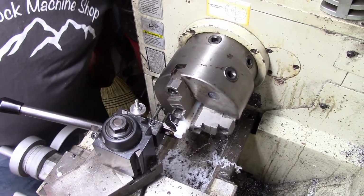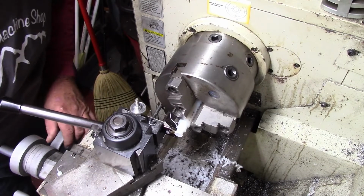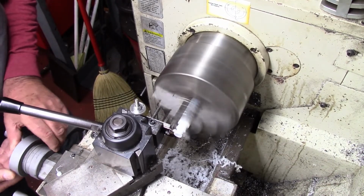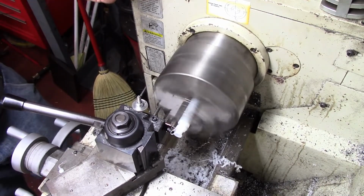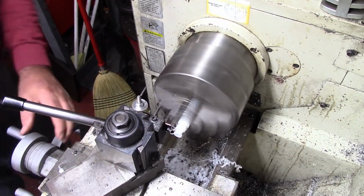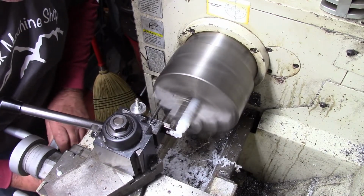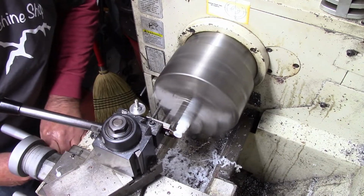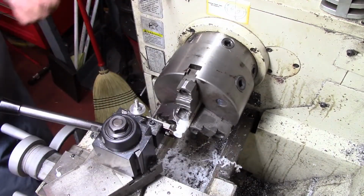We're machining Delrin. I'm just going to use the cutoff tool, because Delrin's fairly soft, and what we're doing is we're cutting this down to size with the cutoff tool. That way I don't have to unchuck it. And again, this is the stuff that's got to be, so to speak, dead nuts. And that way, it's bushing. I'm going to make it to fit this a little tighter than the screw.